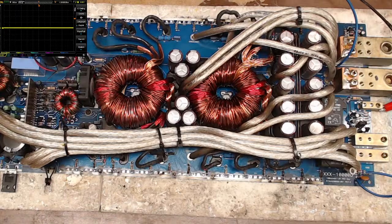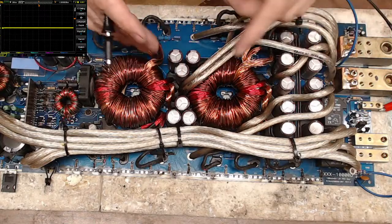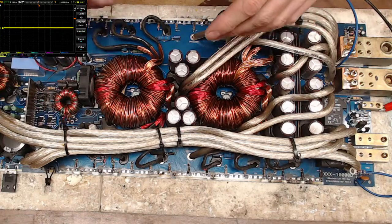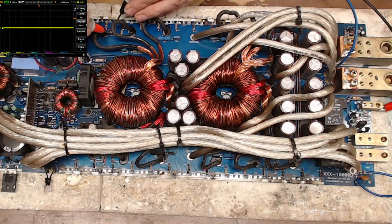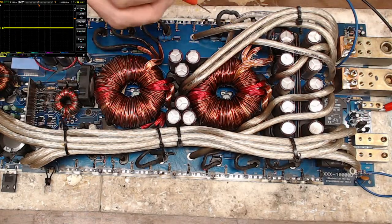Yeah, that's what it is. It's just the change in time. In today's world, you probably would have six transformers here. This is designed, I think, obviously to carry a ton of current, but yeah, so we're looking good. Auxiliary supply is switching. Let's see here. Nice. 12 volts across the zener.